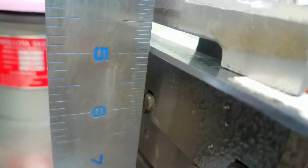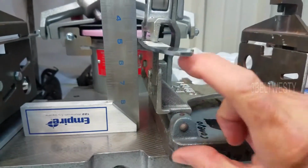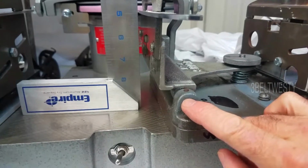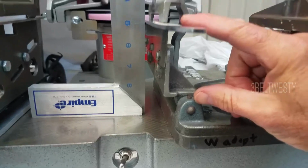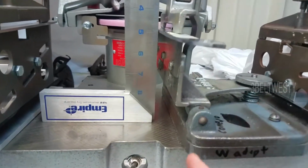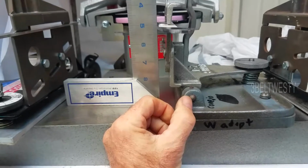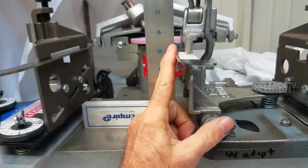You can go ahead and I'm lifting it up. What it's really doing, it's rotating about this point. That's what they call the instant centering mechanisms. And if it was right vertically here, straight up, there would be no motion. So if you're on this side vertically, it's going to raise up, and this side's going to raise down. So they've got the pivot point purposely behind this edge of the blade.